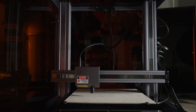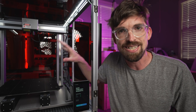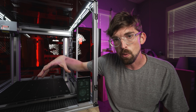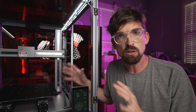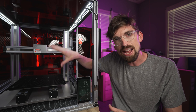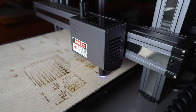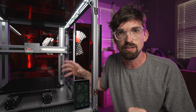Comparing this to other laser diode machines, most of those are in the 400 millimeter range, so those will be bigger. But this works entirely differently because the work bed actually moves — this is a Prusa i3 style machine where the work bed moves in the Y axis and the gantry moves along the X axis. The linear modules are a lot beefier than what you'd typically find, with rods a lot thicker than usual, because they need to handle CNC router loads — meaning carving through wood — so you need something much more substantial.